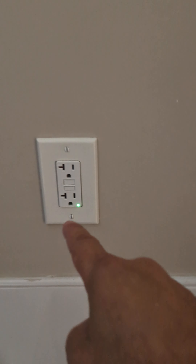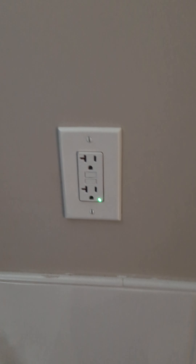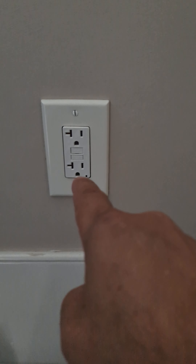Joey, turn that top 15 amp off, but watch what happens when you turn that 15 amp off. This is a 20 amp receptacle. Turn off the other side. So this outlet is going off with all of these. I would think that should be on its own breaker — a 20 amp — because it has a 20 amp load line on it. So these all go out.